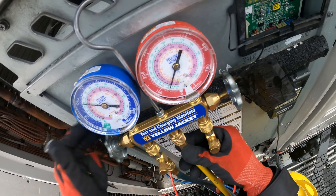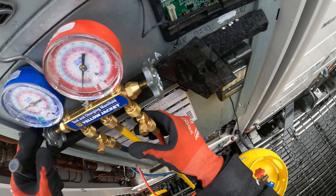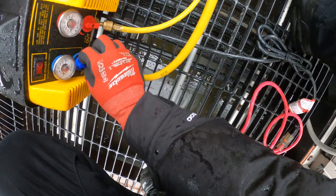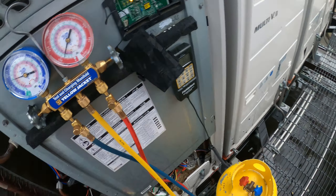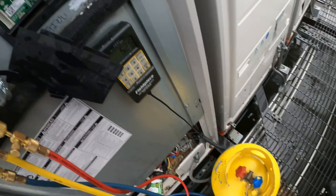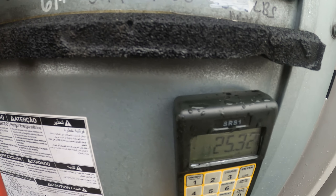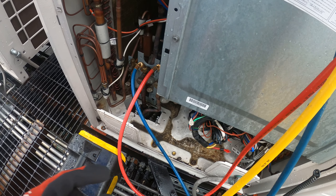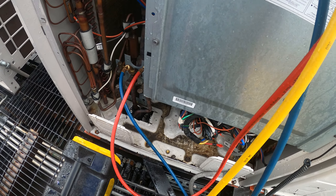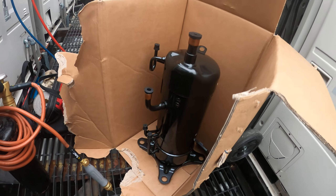V-A-C-C, we're in vacuum mode — it's the first time doing this. We're zeroed out, let's open up our gauges. You can hear it going in — start the machine. So we're pretty much empty. We got 25.3 pounds of refrigerant. Let's put away this equipment and make sure there's no gas left in any of the lines. I pulled from these two — let me just check to make sure there's nothing in there. There's three pipes coming out of here because this is a heat recovery system — you can have heating and cooling at any time. Very tricky.